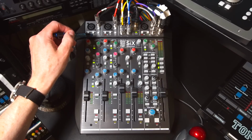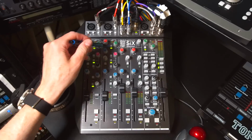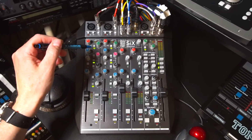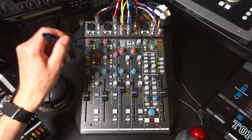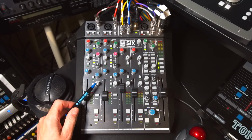Both mono channels have channel compressors and channel equalizers from SSL, and 2 stereo auxiliary sends called stereo cues in SSL's world. Both the channel compressors and channel EQs have individual in-outs, so you can bypass them anytime you want. So the mono channels are very flexible. They even have alternative inputs if you want to use that.